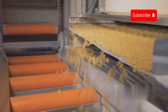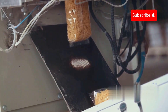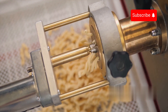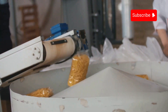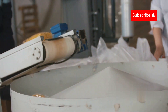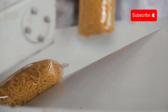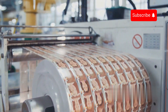The spaghetti is then transported to the packaging area, where advanced automated machinery takes over. These machines are equipped with conveyors and sensors that work in harmony to bundle the spaghetti into predetermined portions. The spaghetti is aligned and grouped into specific weights or quantities, with the system carefully handling the delicate strands to prevent breakage. The grouped portions are then fed into packaging units, where they are enveloped in either plastic or cardboard materials. Machines precisely cut and seal packaging materials around the spaghetti portions. Labelling machines apply labels to each package, including essential product information such as weight, nutritional content and expiration dates. These labels are printed in real time to ensure accuracy and compliance with regulatory standards.